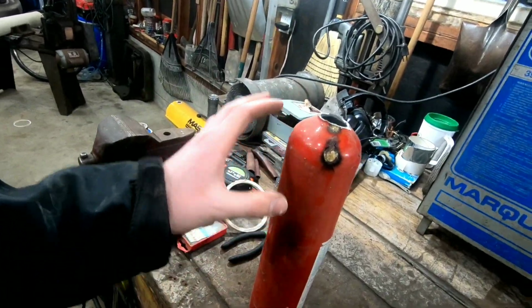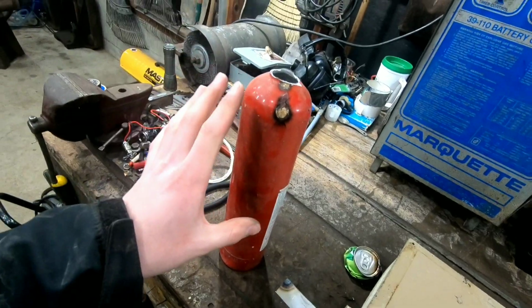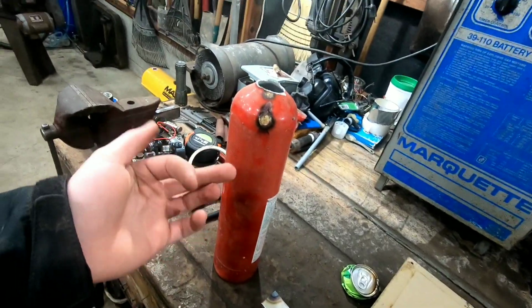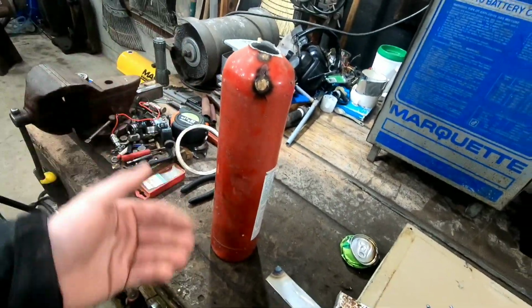And even like this right here, wow, it's still warm down here. It absorbed a lot of heat. This is pretty thick aluminum. It just absorbed too much. If I would have held on there for a really long time, I think it would have burned through, because it's obviously hotter than the melting point of aluminum. But it just absorbs so much heat because it's so thick that it can't heat it up fast enough.